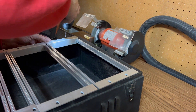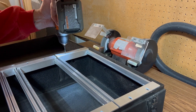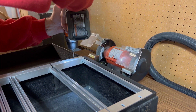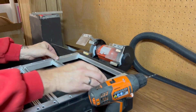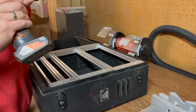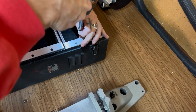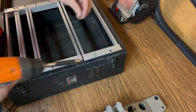But this center punch — gee, that did not leave much of a mark. Can we increase the tension on it? The nice thing is that we have a little bit of room here moving back and forth, because our brackets have a little room. So we need to do that for all the brackets for this case. Center tap might be easier. I have drilled my pilot holes and then this should work now — and that is done properly.